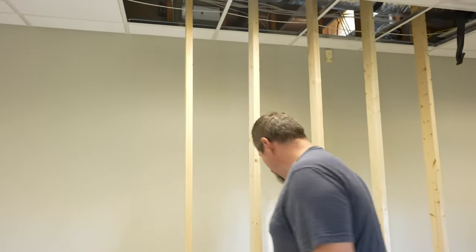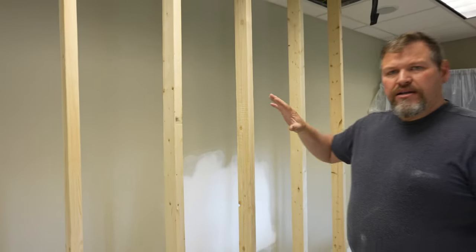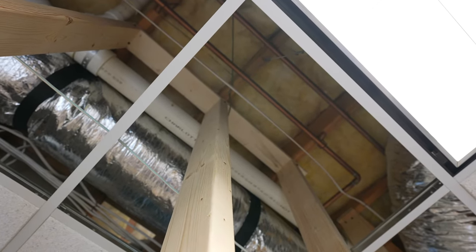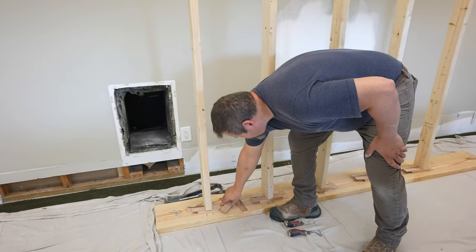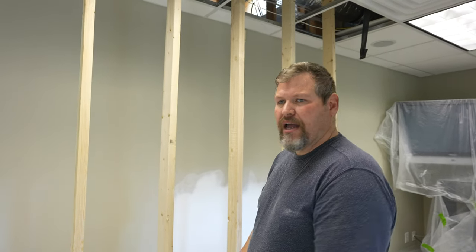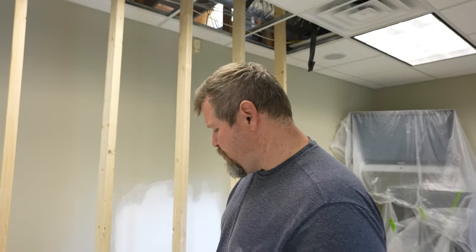When we dug out underneath that footing — which is actually right here on the other side — we wanted to take some of the burden off that footing. So we went up to the bottom of the joist. We threw a 2x4 — we couldn't run it continuous because of the copper pipes — and we came directly below the joist. I threw a 2x10 down and we cut these oak shims and used them as wedges. I know you can buy shoring jacks — we'll buy them eventually — but that way the footing wasn't just hanging there suspended.